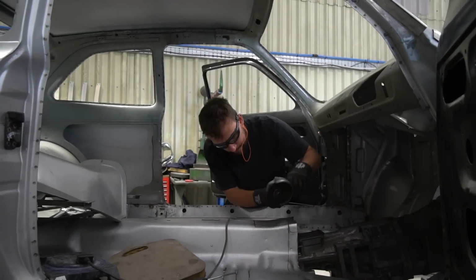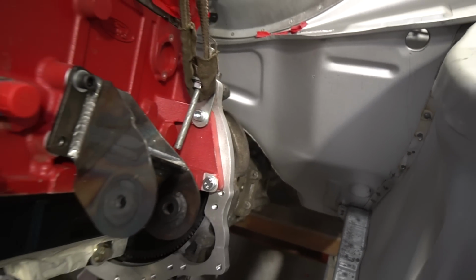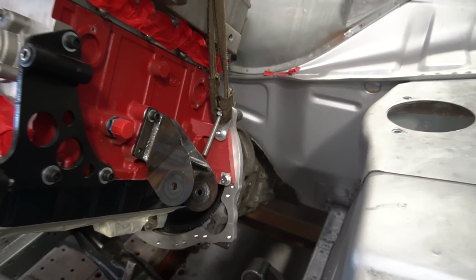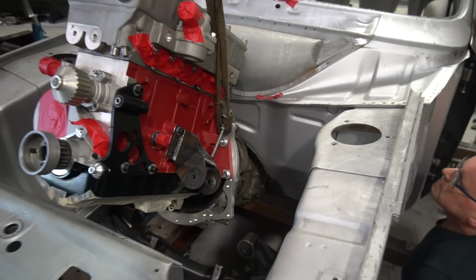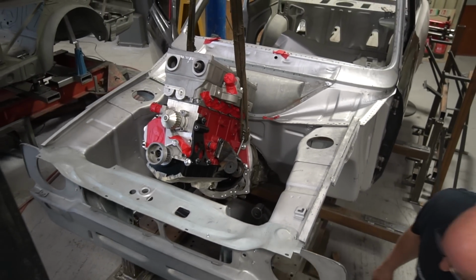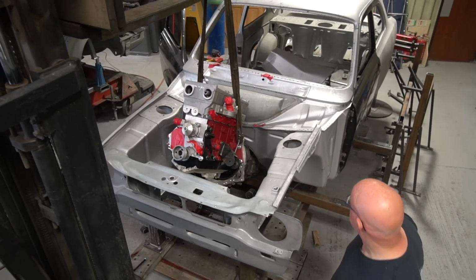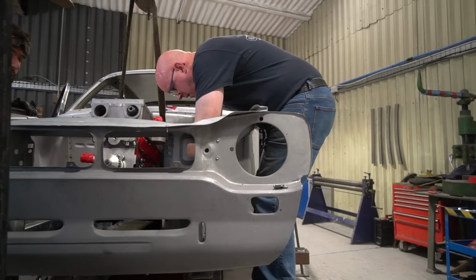For the rest of the gearbox, even including the big PPF mount that sits on the side of the Mazda 5-speed gearbox, the NA and NB Mazda 5-speed box, that all clears the big tunnel, which is really nice because it's a gearbox conversion that I've always wanted to do. They make a lot of sense. They're brilliant gearboxes. The shift quality is great. I've ranted about it before, I'm sure, but they just make a lot of sense.